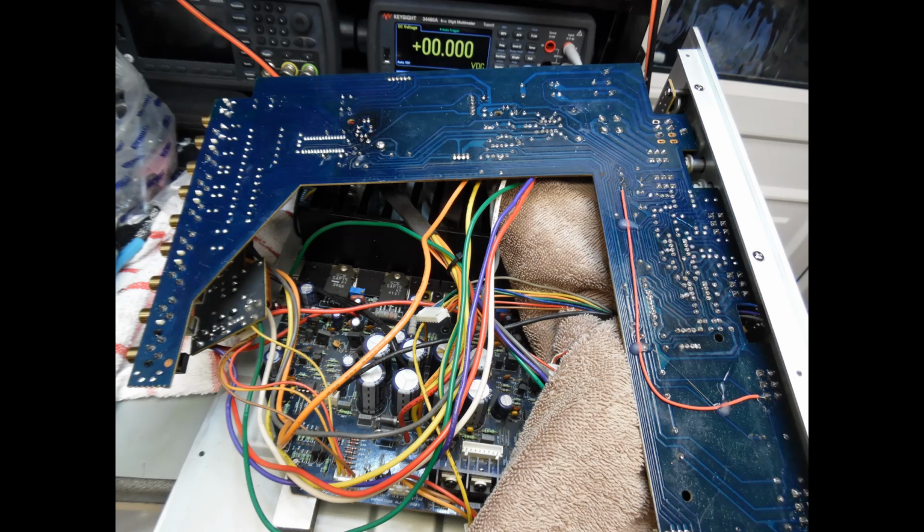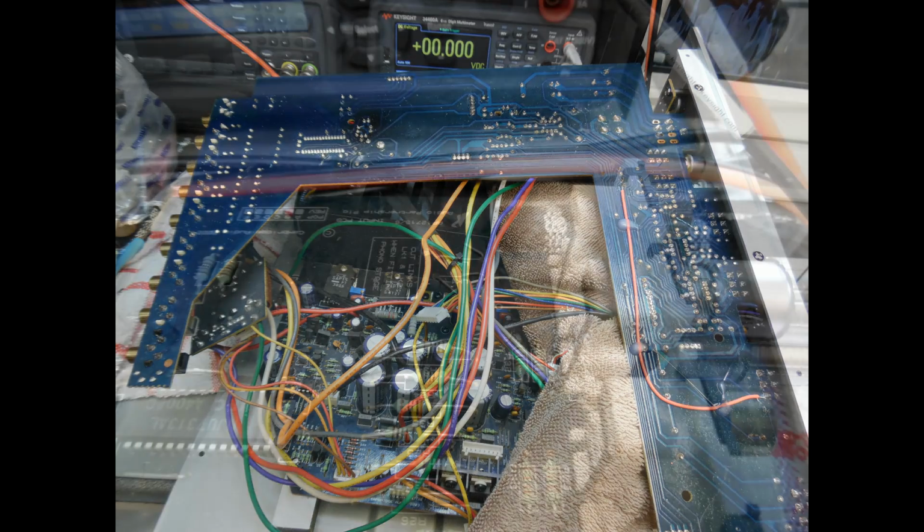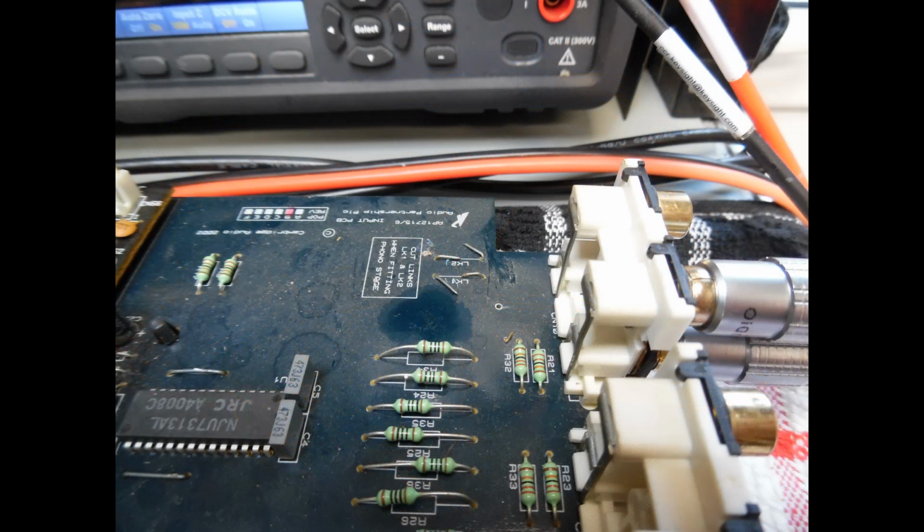You'll get certain areas where it's running hotter than others because the circuit could be more of a power type circuit. But whenever you see this, you've got to verify that you haven't got any dry joints, so just go through there and resolder them. And also on the user controls and switches, often with these Cambridge amps, you can get dry joints as well. So all the boards are checked, and then all necessary suspect joints are reflowed. Once that was done, it was really semi-assembled. I don't do a complete reassemble. What I'm looking to do next is just to test the amplifier and run it through.